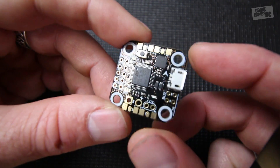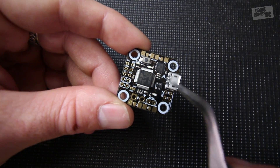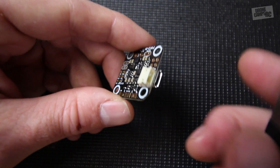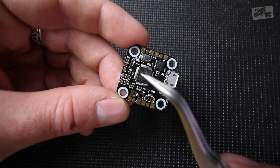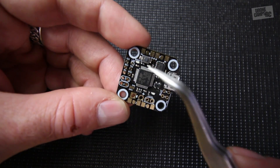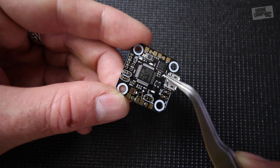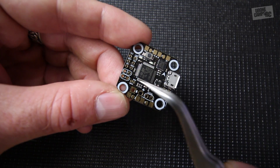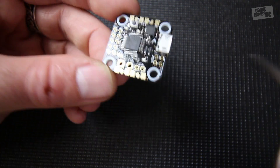One of the big favorites in the micro community right now is the Pico BLX. It supports SBUS, PPM, and there's a DSM port on here for Spectrum guys, so you're not left out. Right in the middle we have the F3 chip, and we have a boot button included, which is great because you don't have solder tabs to bridge like on some other flight controllers — you just push this button and reflash Betaflight from the USB port.